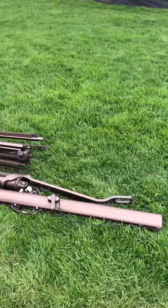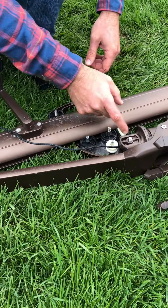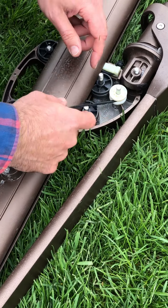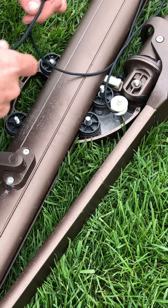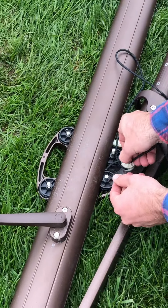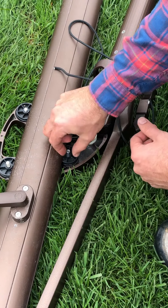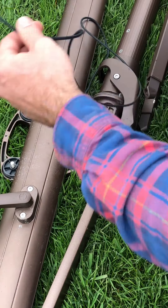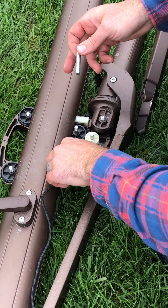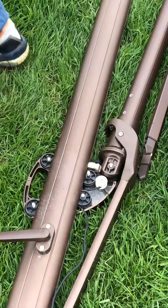So we're going to come down here. If you look at the way the pulleys are set up: the rope goes behind this pulley that's on the inside of the tilt lever, it's going to go in front of the white pulley, and then behind this one. I have a diagram right on my webpage that you can download — it's a PDF file that gives a better description. Sometimes it gets a little tricky to get that through here, so you can just pull this pin up, pop this little pulley out, kind of put it in the channel where the rope goes, and then pop it back into place and put the pin in. Then let's put the grip back on.